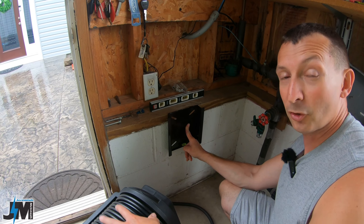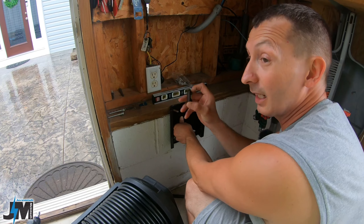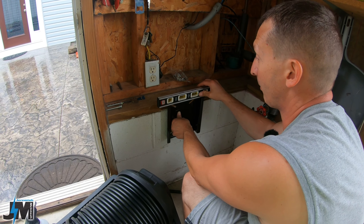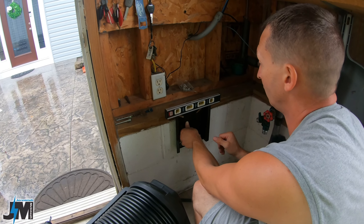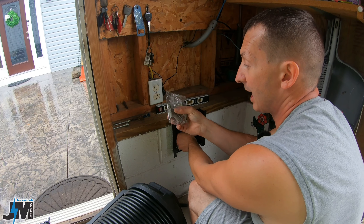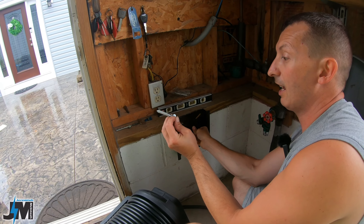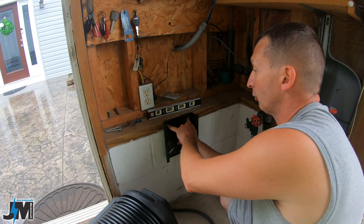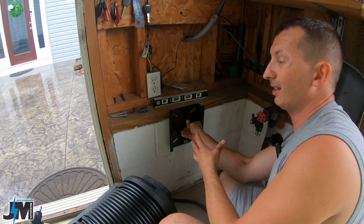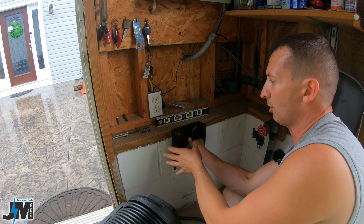The first step to mounting this Grand Falls pressure washer is to mount the mounting bracket. They give you a little magnetic level to help level it up, though I'm using my own level for accuracy across the two points. They provide wall anchors — you drill half-inch holes, pound the anchor in, and use the included lag bolts. I'm going to put two of the lag bolts with added washers directly into my sill plate, and then use two small tapcons down below to hold the bottom.